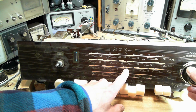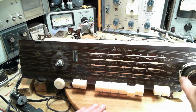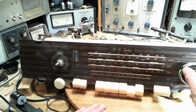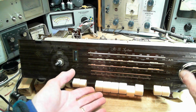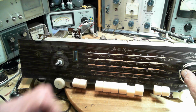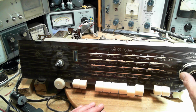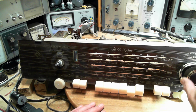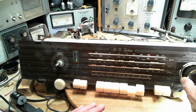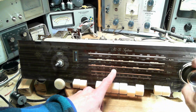I think I went right past some of this stuff. On a radio like this, when you tune quickly, you hear the thump, thump, thump. That's basically the DC voltage being generated in the detector for the brief moment the signal is there, and that DC voltage makes that wumpy sort of sound. Actually, it doesn't quite sound like that, does it? But it's very easy to hear. When you go after it, it comes a little more tricky. Okay, enough about how to tune the radio.